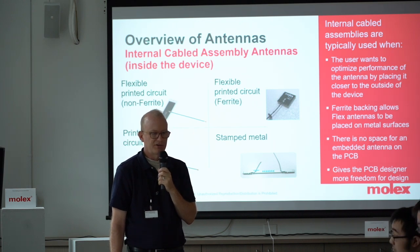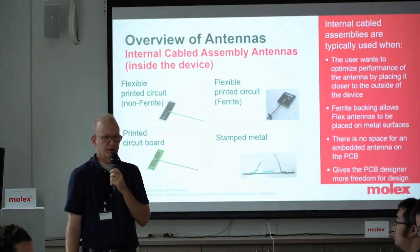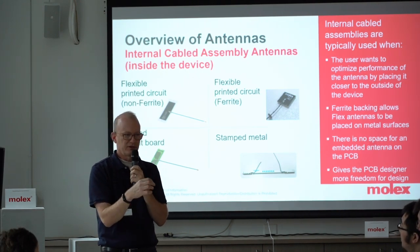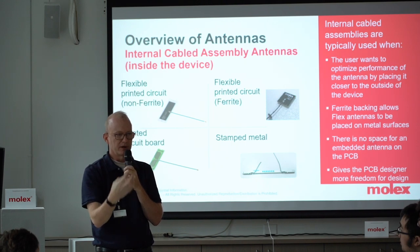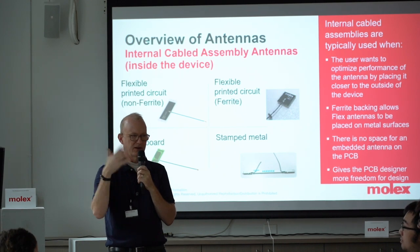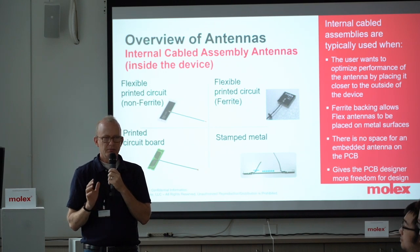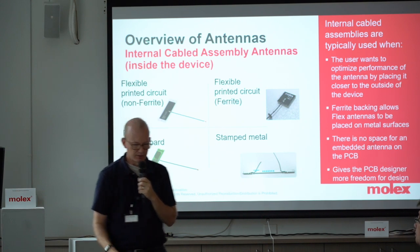What part gets lasered? It's on plastic — that's the technology I'm going to get into more detail on. Essentially what we're doing is lasering a special plastic: the laser burns and scores the surface, and that makes the plastic receptive to plating. We run it through an electroplating process — we're literally growing a metallic surface on there, usually copper. The top coat is applied for anti-corrosion. By using that, you're able to build an antenna kind of like a stamping, but without the challenge of bending and moving slightly — you have a highly defined geometry.